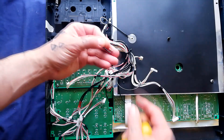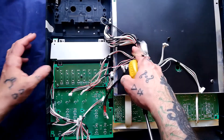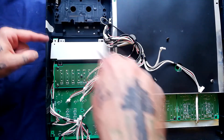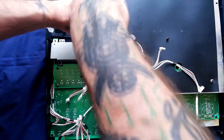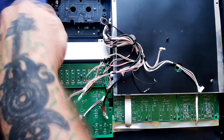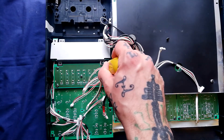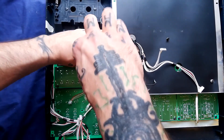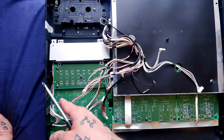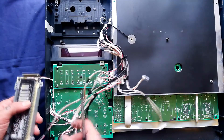There's a little brass metal ferrule screw with a cable tidy in the top left corner of this metal plate, which I assume is shielding and protecting the display unit. I'm going to remove four screws here to see if that gives me access. I'm not suggesting that if you're going to fix one of these you've got to take everything apart the way I'm doing — I'm just showing you how to access everything, because you never know what you might need to replace, desolder, or reflow. One of the things that's intimidating about working on these is just the logistics of getting them apart and knowing where the wiring goes, so at least with these videos you'll have something to refer to if you get lost.